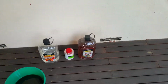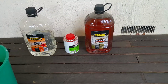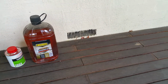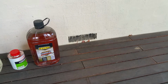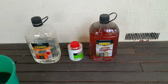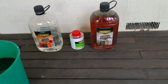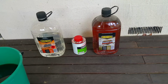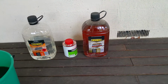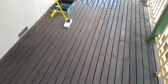Adding a stain to it, look, you just have to make sure that you use an oil-based stain. Now let these cockatoos pass. Thanks, guys. Yeah, so just make sure you use a stain that washes up in turps. Basically, that'll mix in fine with the linseed oil. But with anything, try a test sample first. Make sure you like it.